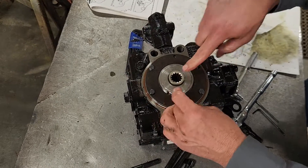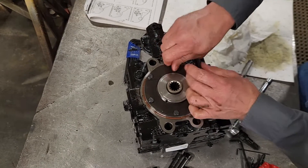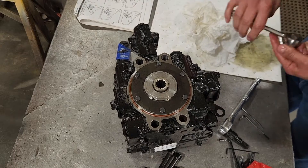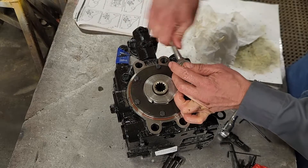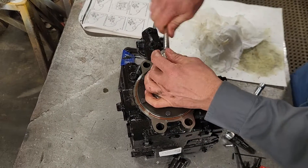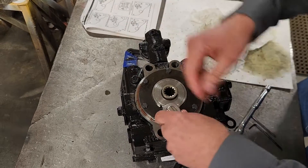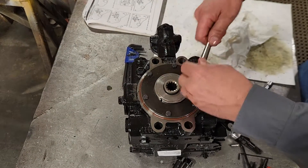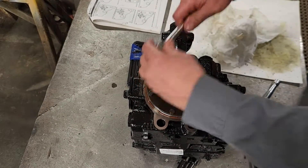At this point I should be able to turn that pump shaft from the bottom, but it may take a good pair of pliers or even a small pipe wrench to turn it — it's going to be stiff. But I'm done with my charge pump as I've got the shaft lined up, so I can go ahead and tighten that using a standard crisscross torque pattern just like you would anything. I believe those are probably only about 15 foot-pounds or less — I'll circle back to confirm that.